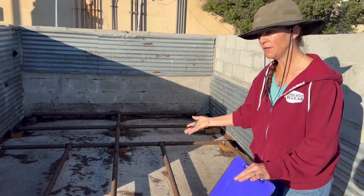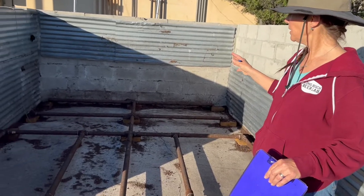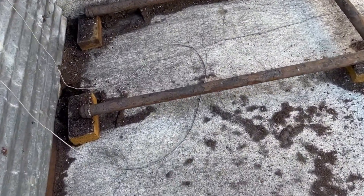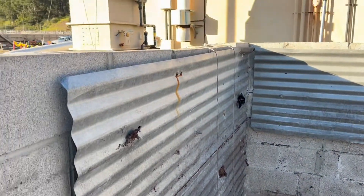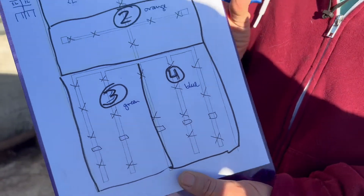We wanted to show you the manifold and point out that we do put temperature probes throughout the soil. Most of them get put in after the soil gets dumped, but since we have them distributed low, we put two in where the trucks aren't going to drive before the soil gets dumped, because it's deep back there and we want to get them on the bottom. Then we map it on our map so that every time we cook the soil, we're moving those probes around to try to target where we think it's going to be the coldest spot in the pile.